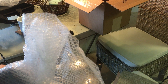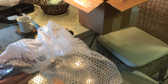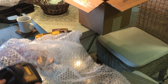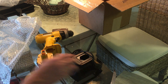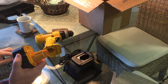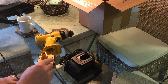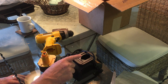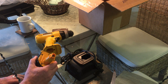I've already done some searching on the web and there aren't any direct replacements out there, so we're going to make our own battery pack. This is the charger for the nickel metal battery, and we're going to have to come up with a different charger for the lithium-ion battery, because the nickel metal battery charger won't control the charge properly for lithium-ion.